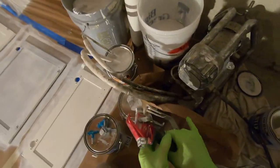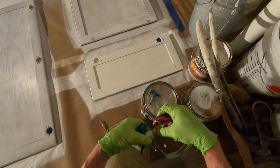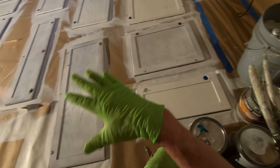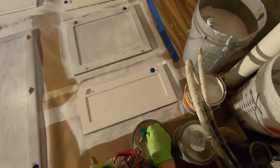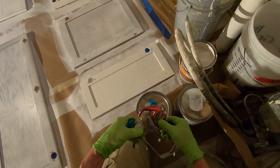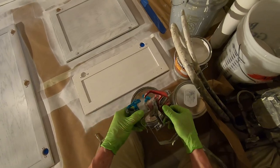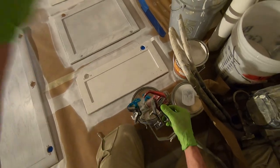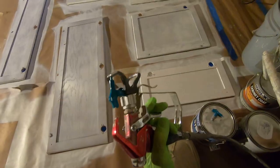That's how you set up. Now we'll go ahead and put our tip on. We talked yesterday about the tip size. We're going to use a 9-thousandths for the cabinet doors — that's going to give us a little smaller spray. On the large doors, we're going to go to our 15-thousandths. You can use anything from an 11, 13, or 15 on your doors. If you haven't experienced a lot of spraying, you're probably going to want to stay with a smaller tip. I'm doing the 15 just for production — I can spray faster, but I'm going to have to move faster, and it's going to be easier to get runs if I get too heavy.